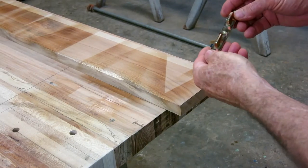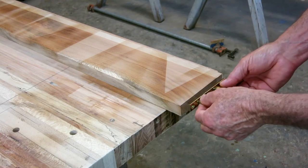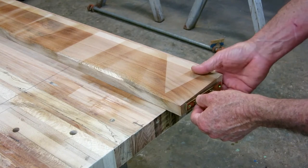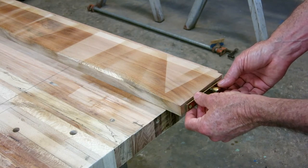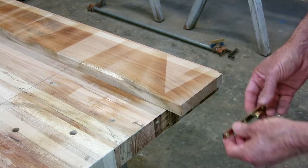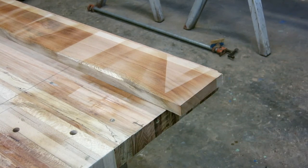This little bracket has to be mortised into the end of the rail and there's not a lot of room for error. I'm going to have to make some sort of jig and I'm definitely going to use the router, but there's not enough surface here to balance the router on, so I need to make a jig to hold the router up.